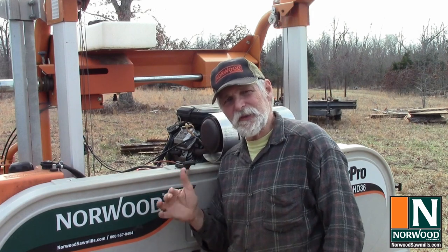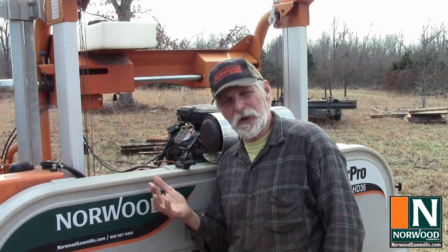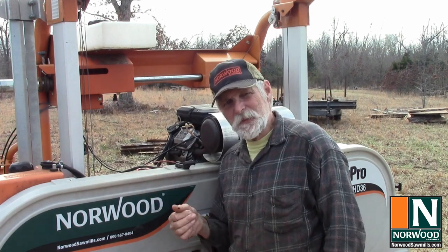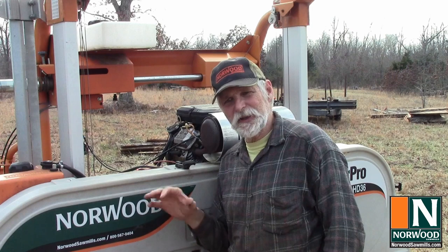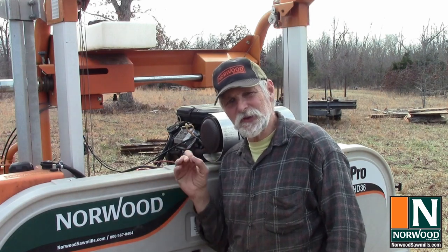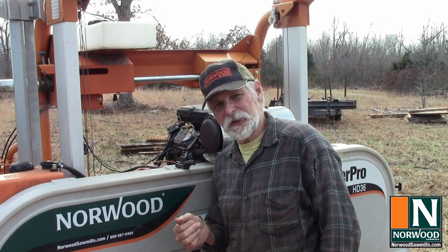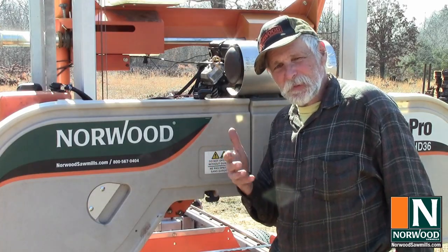Yeah, a new engine, I think 5 to 10 hours for break-in. Then you change the oil, and after that, follow the manufacturer's recommendation. It's probably one of the cheapest insurances that you can have, that your engine is going to have a long life to it. So we're going to try an experiment here.